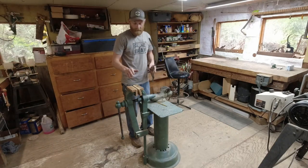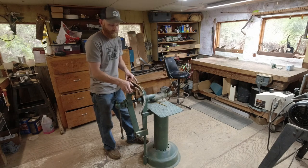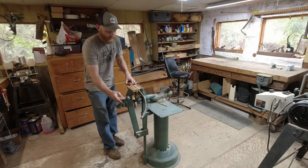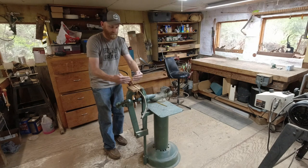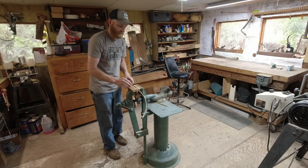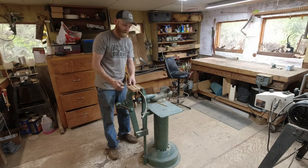I use them for everything, but I need one that is good for bow making. I've been using this one for years and it works alright — I have my version of soft jaws, just chunks of wood in there. The problem is they're parallel, and a leg vise actually swings on an arc, so it's not even when it closes. You get pressure on one side and not the other.